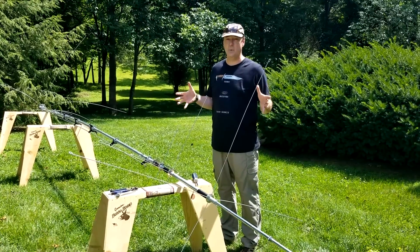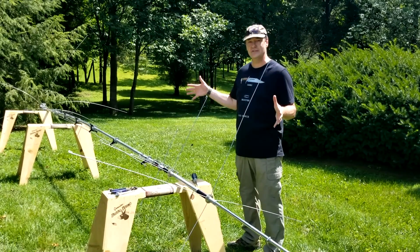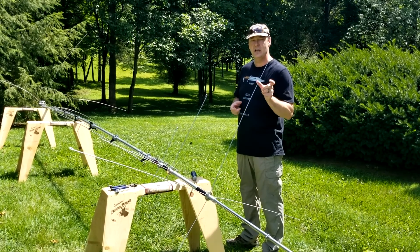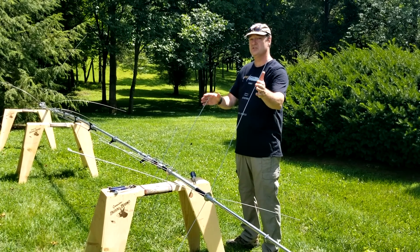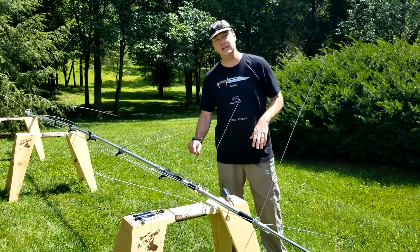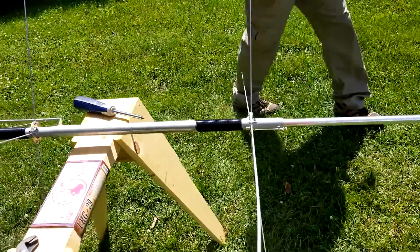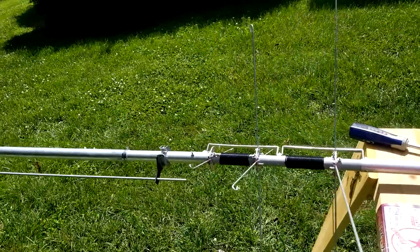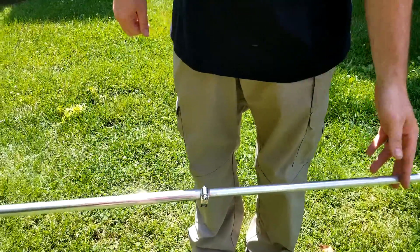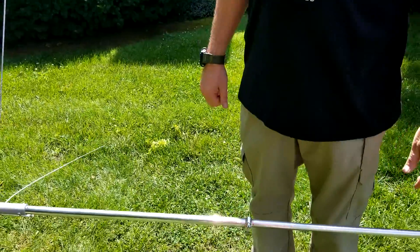We're back. I've got KY4CKP, Chris, behind the camera. We've taken the antenna down, and what we're going to do is we noticed on the MFJ-269 analyzer that we needed to make some adjustments on these spokes — called capacity hats. We've got one for 40, 30, 20, and 15. The final pole at the top, which gives additional length, is also part of the 40-meter band, and we've lengthened it by about 3 inches because that's what the instructions indicated.